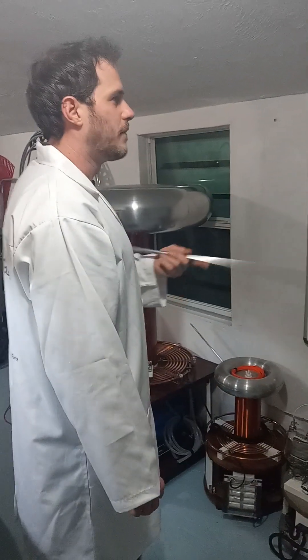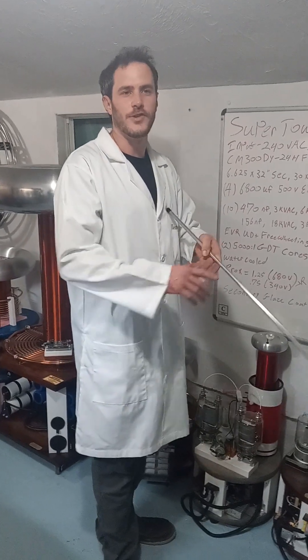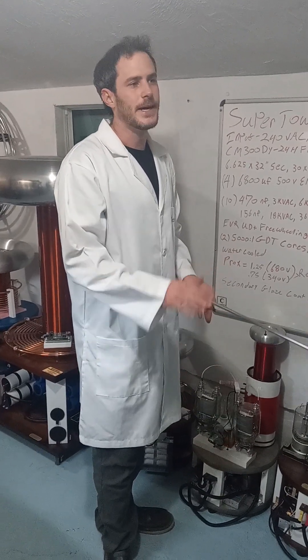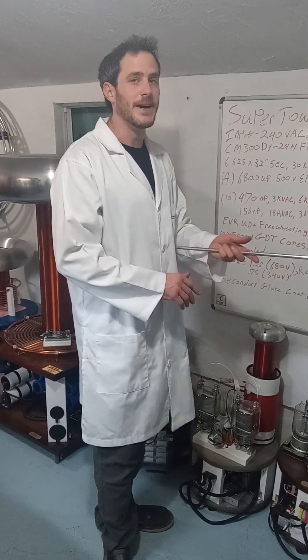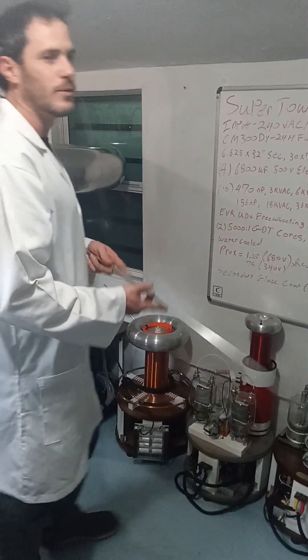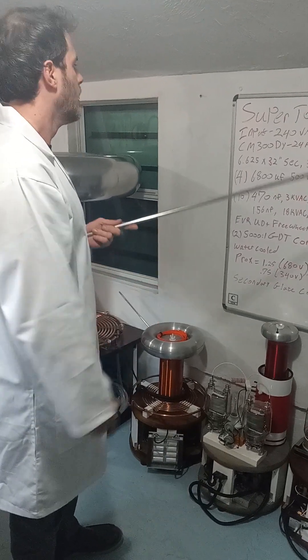There is a reason for detuning, especially at DRSSTC — for a longer power on time, when you're freewheeling, what you're doing is you're cutting the current. Instead of just shutting the bridge off completely, you're letting it ramp down. While that ramp down is happening, you have a huge voltage spike, and the more you detune it, the more you can control that. So you can do longer on-times without as much heat since you're not pulling as much current.